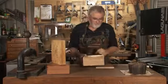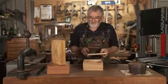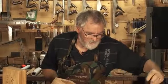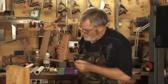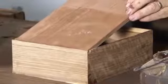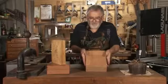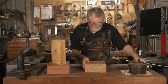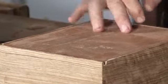With the veneer one, you'll notice the glue up is the same, but the precision on the fit of the bottom doesn't really matter. So it doesn't have to be as tight. And that'll be revealed a little bit later on. So I'll just glue this one up. Once it's glued, again, just drop it in, and it doesn't matter if there's gaps like that because we'll sort that out later on. But try and even them up so it's even both sides. Same thing, get a heavy weight, put it on the top of that and let it dry.